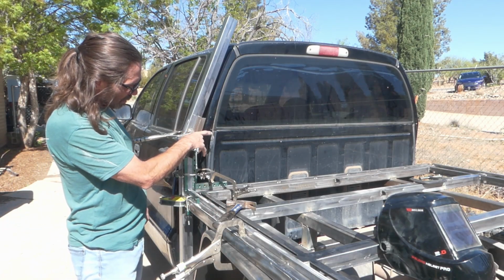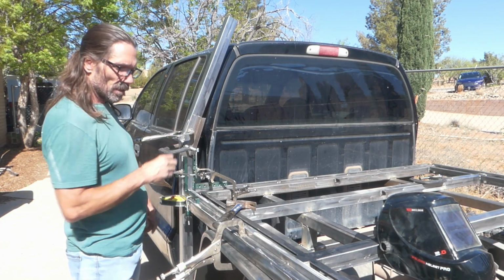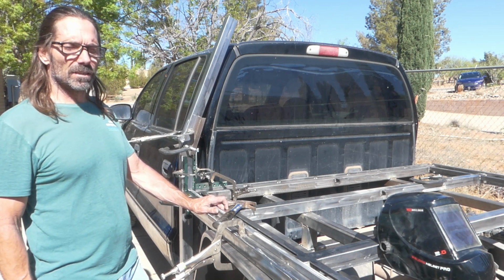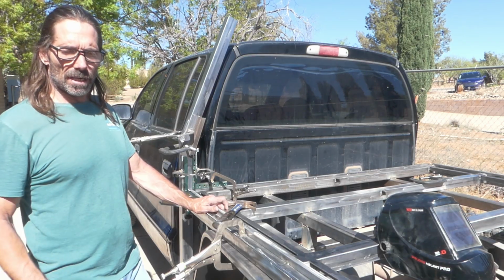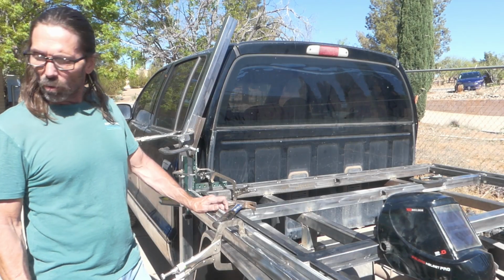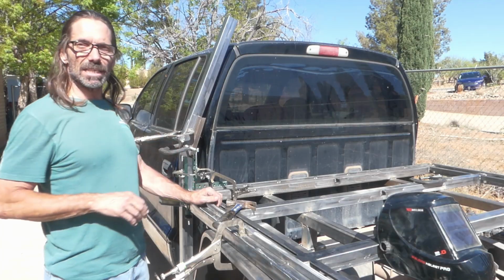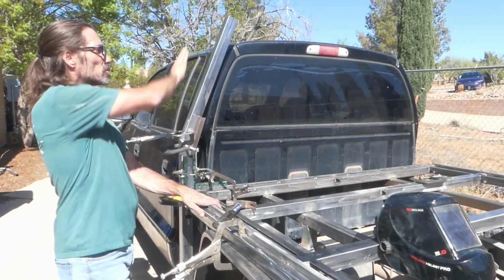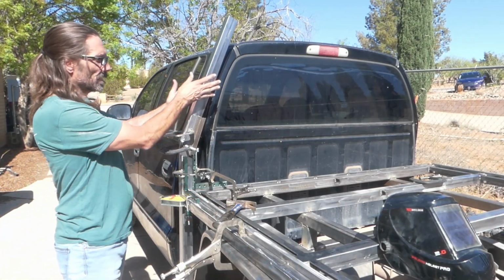We know these are 2 inches. I knew this was 3/4 of an inch here, and that allowed me to, once I punched those numbers in, it gave me an angle of about 21 point. I can't remember exactly, but the angle on each one of these turned out to be about 10.8, and that gives me a really nice slope up right where I want it to be.